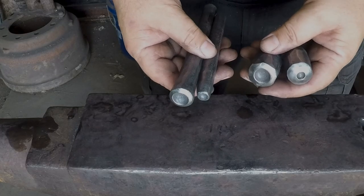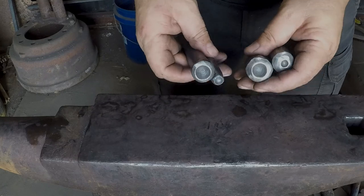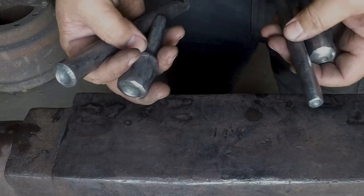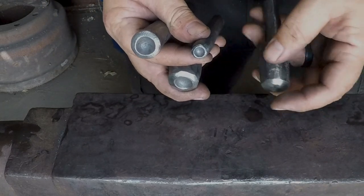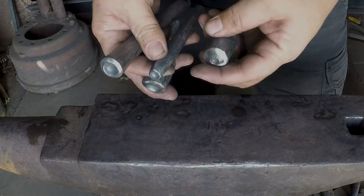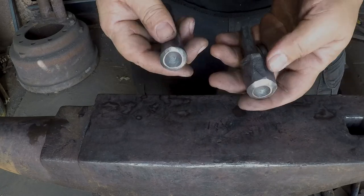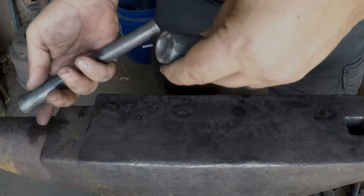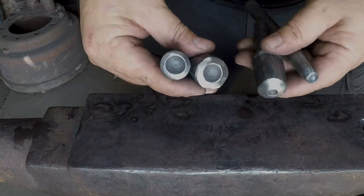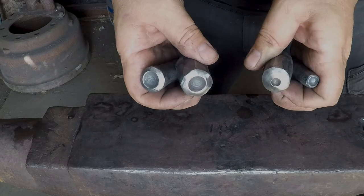A little bit of wire wheeling and they are good to go. I'm pretty happy with the way these came out. I'm not going to harden them — these smaller ones almost certainly won't need it. I've done quite a bit of riveting with just a ball punch stamped into mild steel, and these smaller ones get formed cold anyway. The larger one I may end up having to revisit later. So, if you're looking to make a couple sets of rivet sets, I hope this video helped or at least was entertaining. Thank you for watching and I will see you next time.